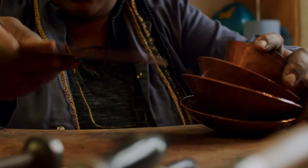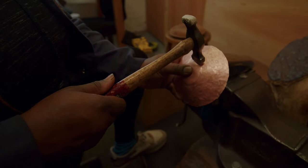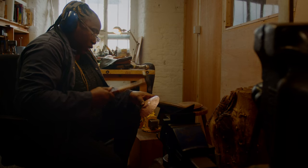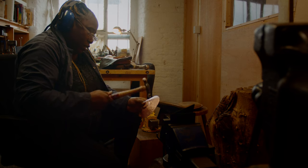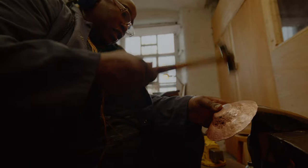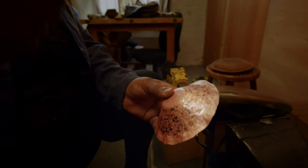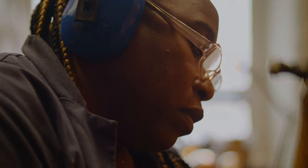It's tough going to start off with because you do get a literally a flat piece of sheet or a disc, and then you would start to raise it using a specific traditional technique. You also have to listen to the metal as you're hitting. It's quite a nice thing to just relax and enjoy the rhythm of the making. You can hit it too hard, you can labour and stress the material, so I'm assessing it all the time.